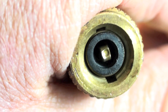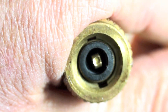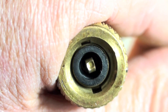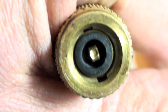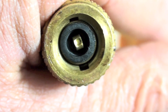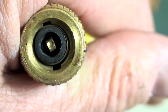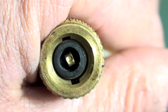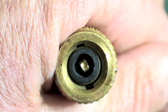Also, when you put these new gaskets in, they're oftentimes not seated in real well. So if you're hooking this up to a unit and you're blowing refrigerant or nitrogen and so on, recheck these things a couple of times and make sure they are still in there. Because sometimes they'll blow out when you blow either nitrogen or refrigerant. So watch that — that's true on new sets too; when you get a new set it's very common.